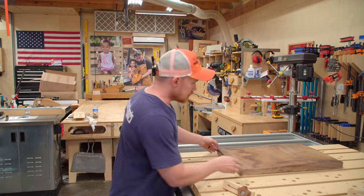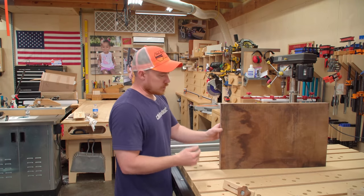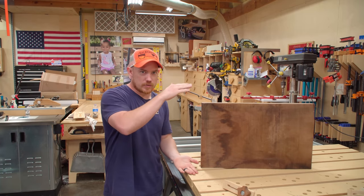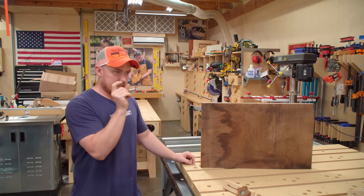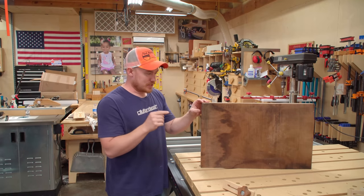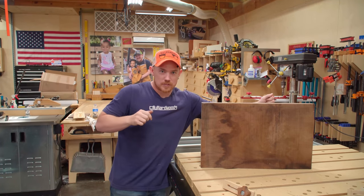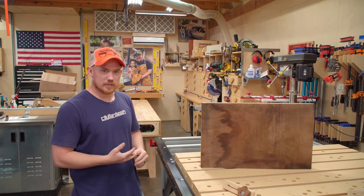That something else is this big old chunk of walnut. This was cut out of a walnut slab. The chest that I'm working on, the center divider is just one big piece of walnut. It's crazy. The specs call for something like a 14 3/4 inch wide single piece of walnut, exactly 1 inch thick, that fits inside of a dado front and back. And the crazy part is at the top, there's a half inch hole drilled all the way through the board, and it bolts the front and back of the chest together. Crazy, right?